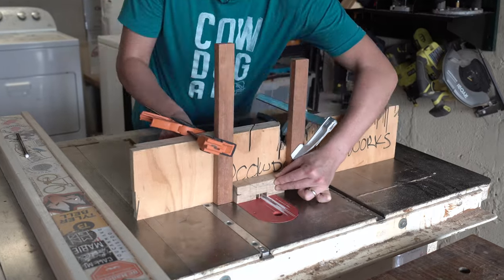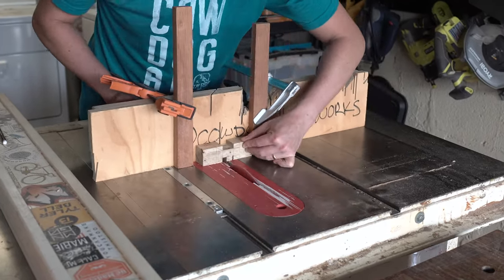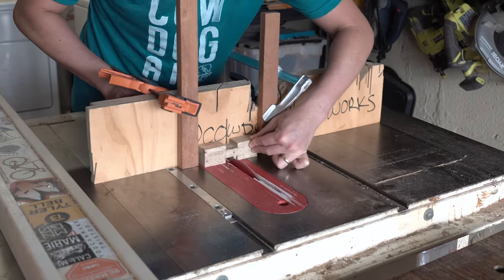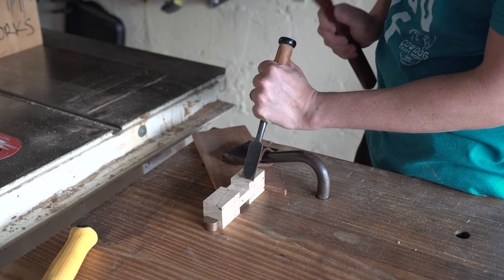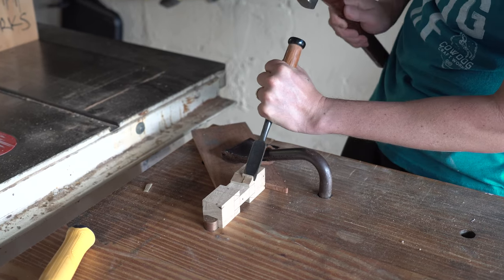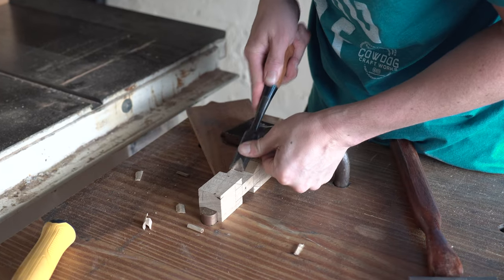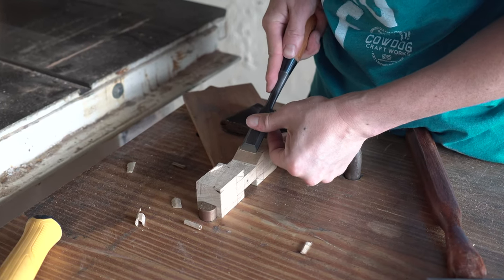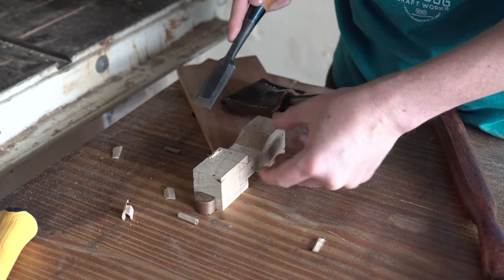You'll also notice that I'm using the polished finish blade from Diablo Tools. This was sent to me as part of the Home Depot perspective, and I'm still not great about switching blades in and out for rip and cross cuts, but I did notice that this did leave a wonderful finish on end grain cuts that was similar to a 220 grit finish. Also, I ripped a few boards with it too, cause, you know, lazy, and it left a similar finish as well.